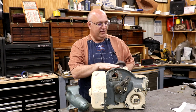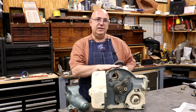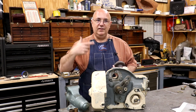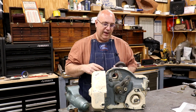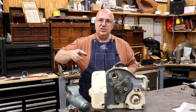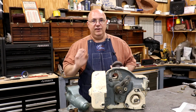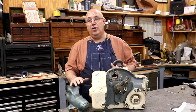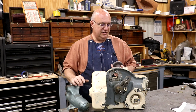What is a lead attachment? This is an attachment that ties into the end of my milling machine table. You put a gear on the handle that is turning as you move the table across. Through a train of gears, it creates the rotation of a shaft that will rotate a dividing head and allow you to cut a spiral gear — specifically for cutting what we call leads, which is any type of spiral milling job.